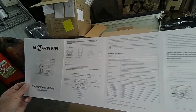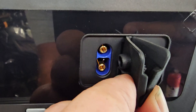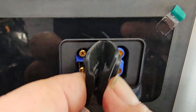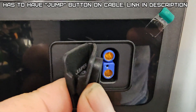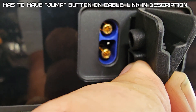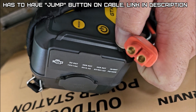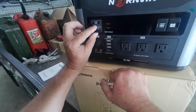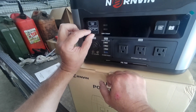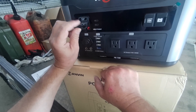Nice big user's manual. That's where your jumper cable connects — notice it has that third pin, so it's not a standard cable for the jump or the external battery. The one off my jump pack will not fit it; it only has two pins, not that third small pin. AC input is 1500 watts, input 120 volts at 10 amps, and 400-watt solar charging.